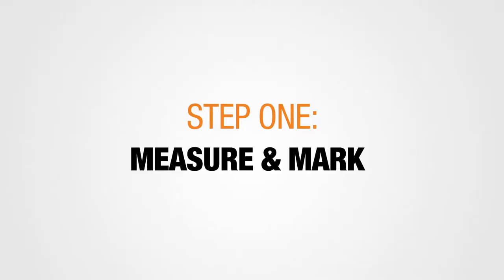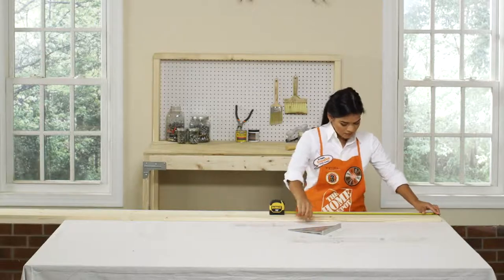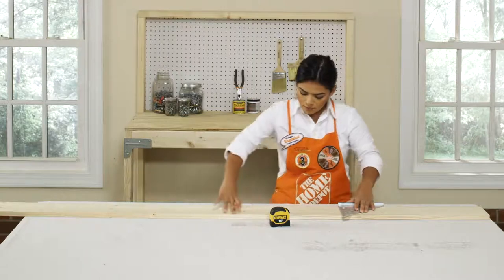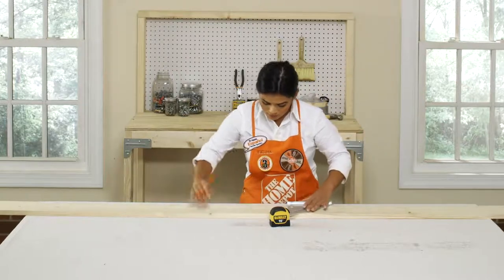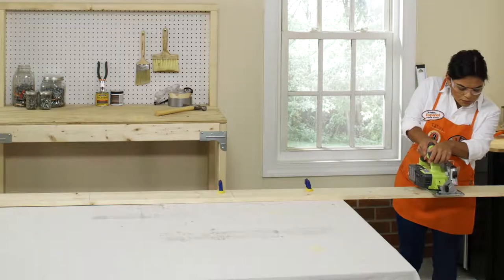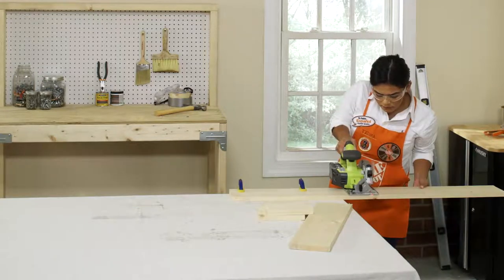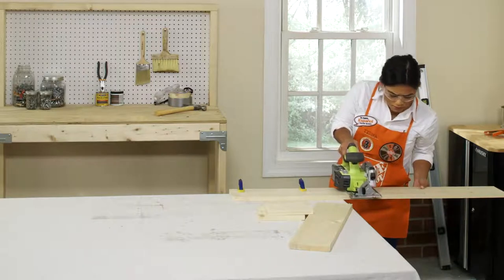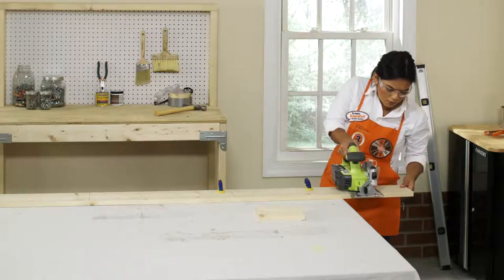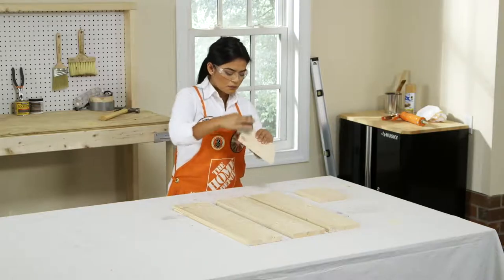Let's get started. Using your measuring tape, make and mark 23 inches from the end of your board. Use your carpenter square and pencil to draw a square line across the board. Using a circular saw, cut along the line, making sure to leave a full 23 inch piece. Now use that piece as a template to mark and cut identical second and third pieces. Do the same with the two 7 inch pieces. Use the sanding block to smooth any rough edges.